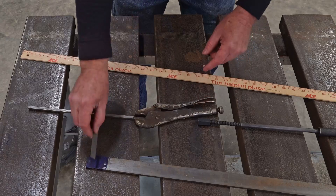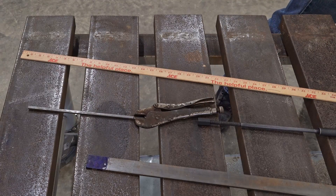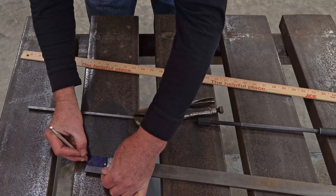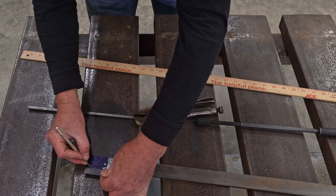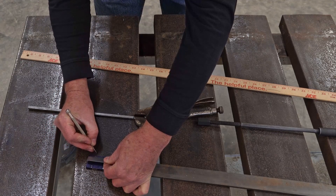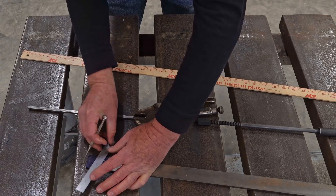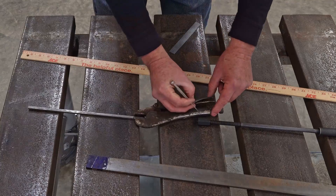So I'm going to cut that piece out. I've already blued it — I'll mark all the way to the edge: half inch there, three quarters inch up here, draw my line across, and cut that piece of metal that'll go right in here.